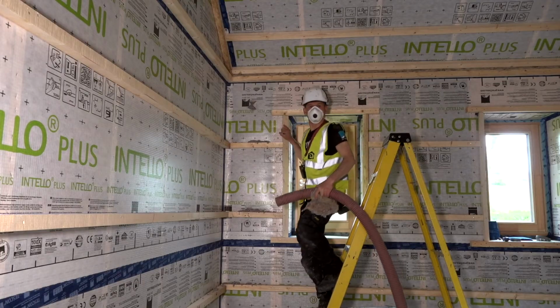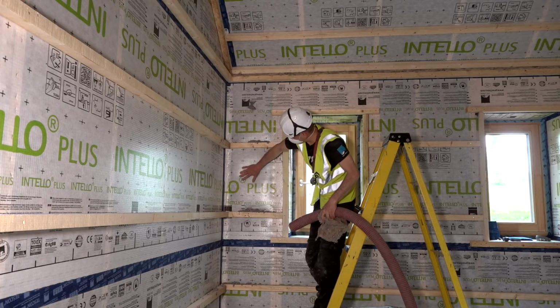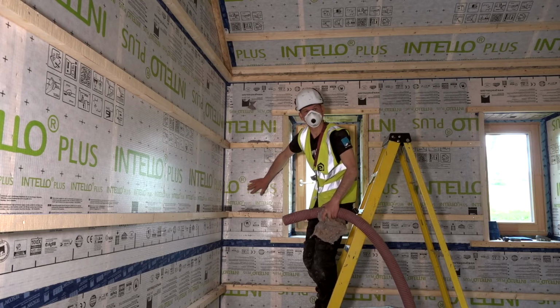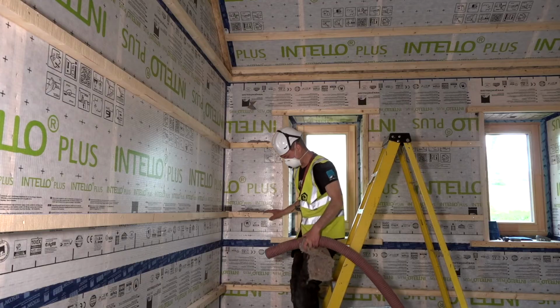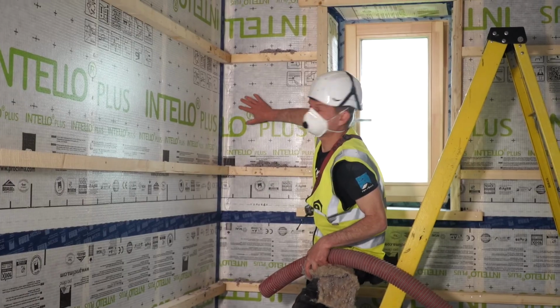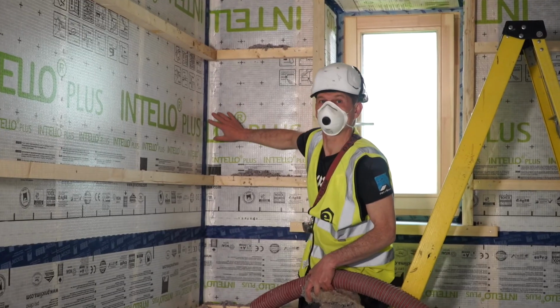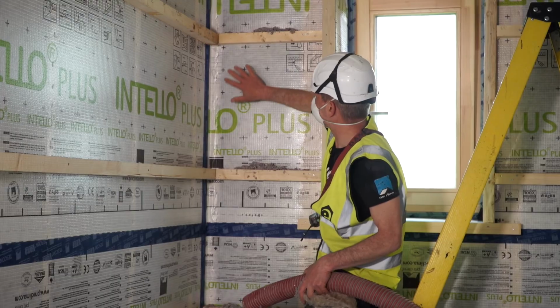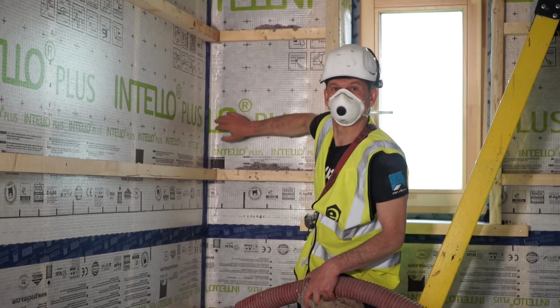And that's the first bay complete, and you can already feel it's nice and tight, a good dense install. First bit of quality control. If that feels weak, then the pressure wasn't enough. If it's too hard, then I would reduce the pressure, but this just feels spot on here.